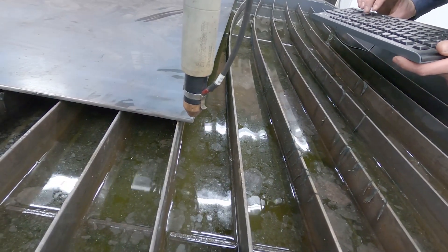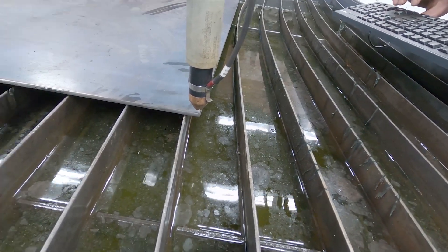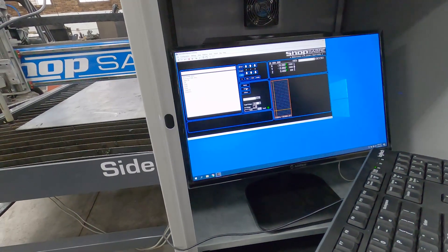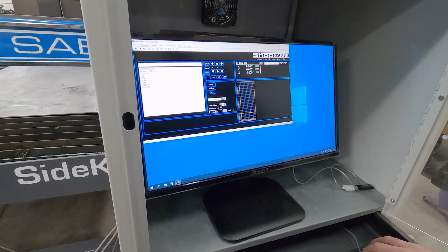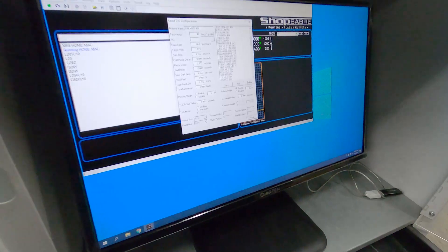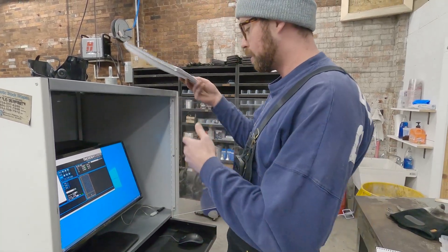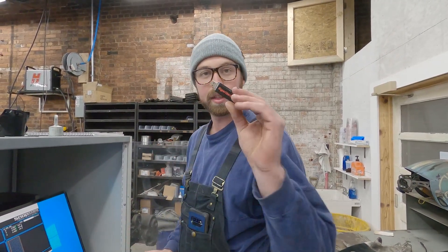We click X and Y zero and we're good. Now we want to set up the cutting parameters for quarter inch steel at 85 amps. Save that, hit done — now everything's ready to cut. All we need to do is upload the file and hit go, and we upload it to this pen drive. They do make laser attachments for this — it's kind of like a video game.